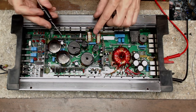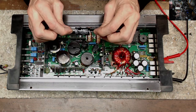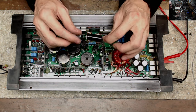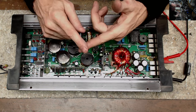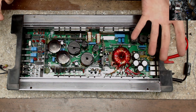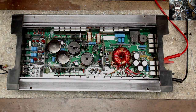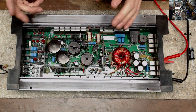I have replaced the bipolar capacitors with some 47 microfarad, 250 volt electrolytic capacitors. With the output filtering section you have a little bit of leeway when it comes to filtering, and what I am looking for is noisy signals. If you don't have the right output filtering it's not going to work right. I have found that these 1100s do work quite well with the 47 microfarad capacitor, which is really close to their original 33 microfarad capacitors — that's why I use them.